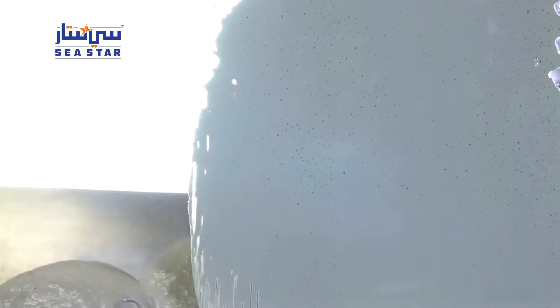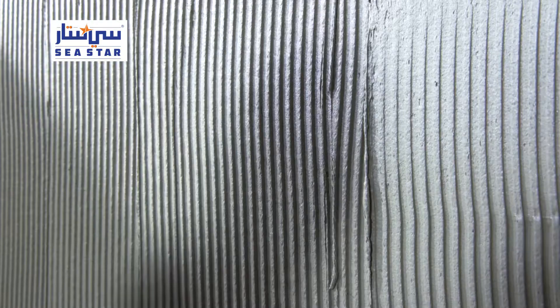Just a 2 mm thick coat of the flexible waterproofing membrane protects against water and offers high tensile strength. Combing the waterproofing membrane with an 8 mm notch trowel ensures that it dries to form a coat at least 2 mm thick.